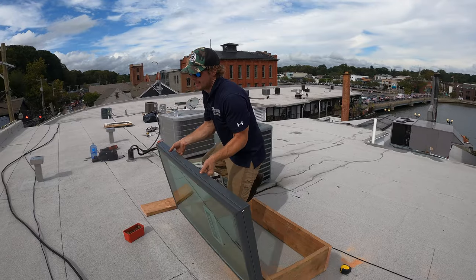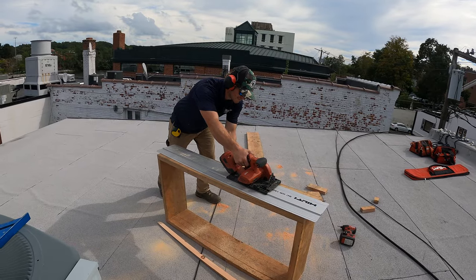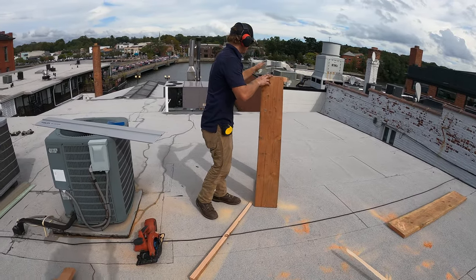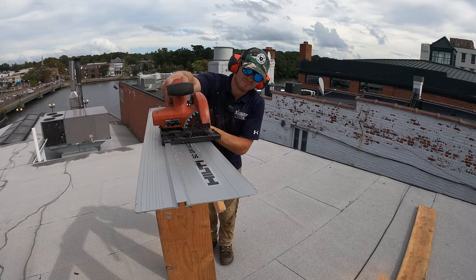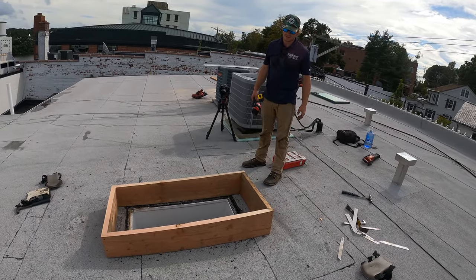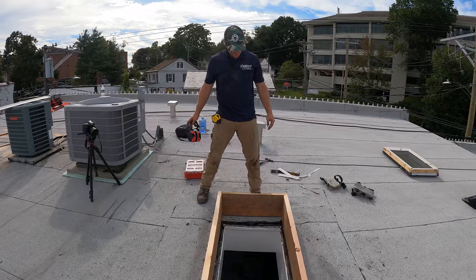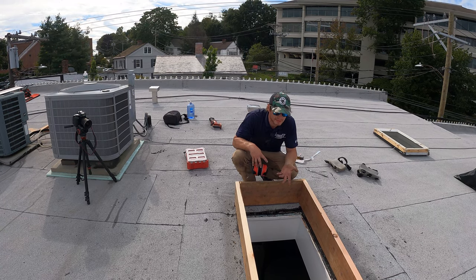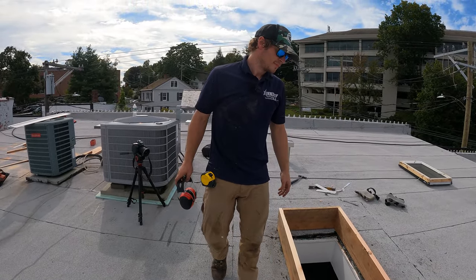As you can see, a curb mount skylight is basically just like a hat — just like that. Now the curb is much bigger than the hole the original skylight came out of, because this is a standard size skylight, not a custom one. So what we're going to do is fill a piece of wood in here to give them something to finish the inside with — whether they want sheetrock, shiplap, or something nice, it'll actually look good inside the building. Let's cut pieces for the inside, then secure the skylight down and roof it in.